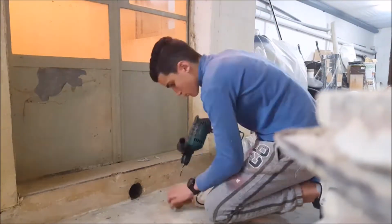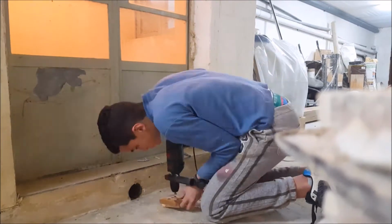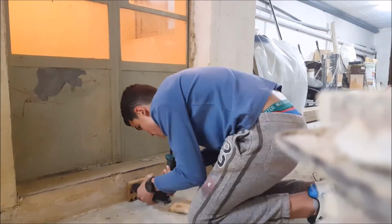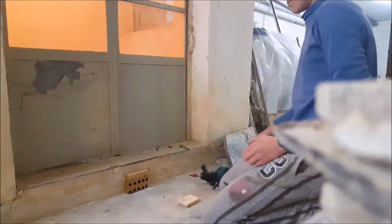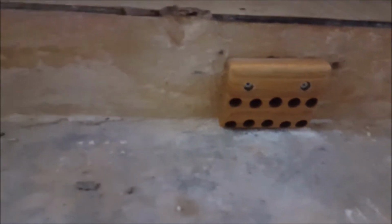After the finish dried, I drilled holes in the vent cover for screws, and used a countersink bit so that the screws get countersunk. Then I marked and drilled the holes for the screws. And then finally, I screwed the screws in place. At the end, the vent cover came out pretty well and air and water could pass very easily.